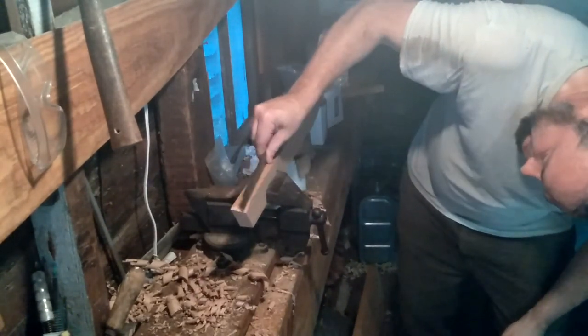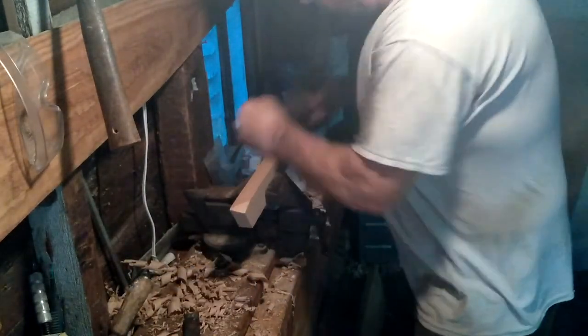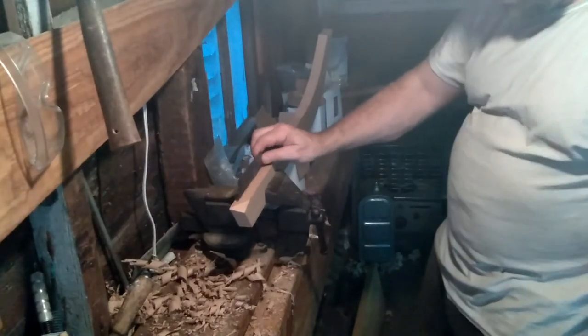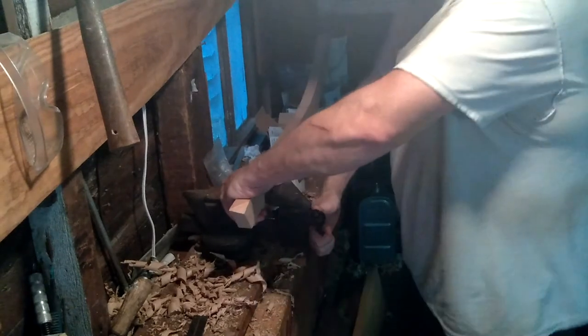And of course it's got the simplicity to build of any dory. Simple and strong construction method. And these days with the latest and greatest goops and goos and paints and potions, you don't even need to make the hull watertight. You can put a layer of glass on it and that'll do the watertighting for you, as long as you get the parts and pieces to fit reasonably close.